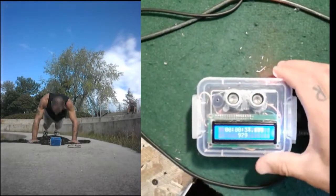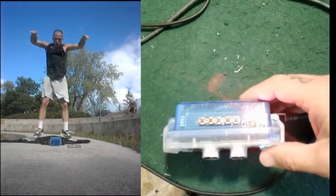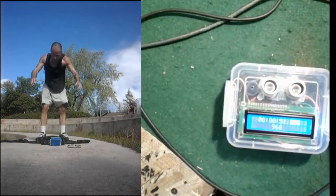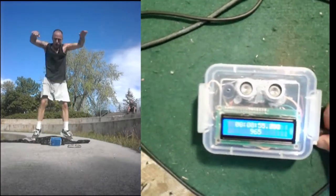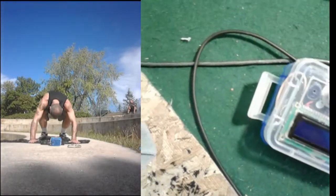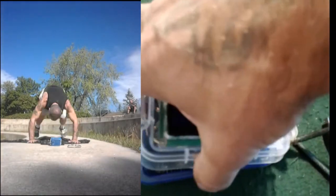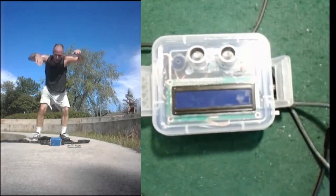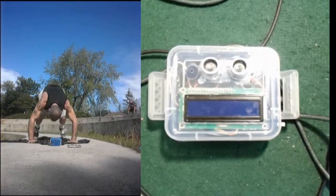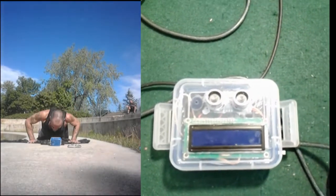It took me about two and a half weeks to make. There was a bit of a headache — I had to remake the button voltage divider because I was using hot glue, and apparently hot glue damages resistors. It's improved and getting better, and I've got other ideas. I've got rechargeable batteries on the way. We can open this up and have a look inside — it's really crowded, with the battery, dense wiring, all that. There's a square battery in there and plans for rechargeable lithium ion batteries. For now it's working on the square battery, and it's freaking awesome. It rocks.